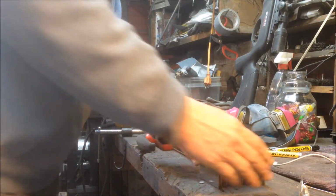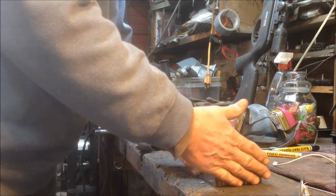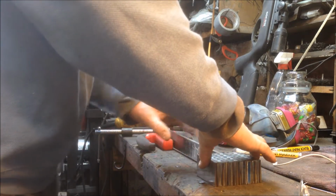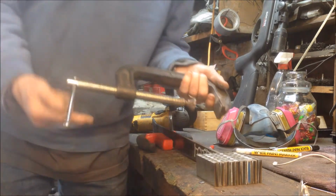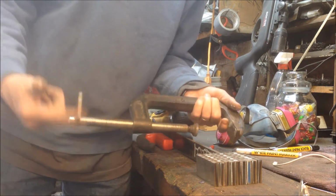1084, 1084. And what I always do is I always set them up so they're smooth on this high side. It'll be a little uneven sometimes along the back, but it evens out as you start the weld. So I kind of get them laying out like this. Get my clamp to just kind of get this started.